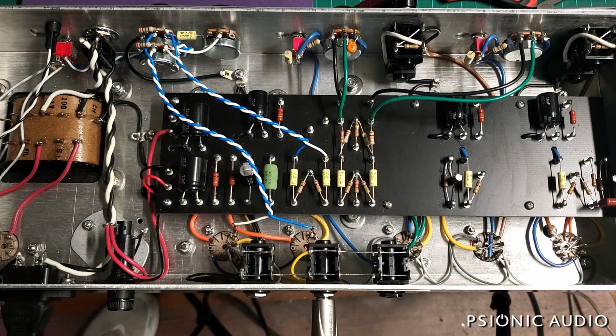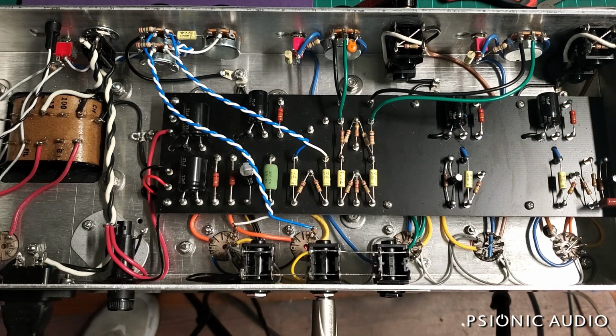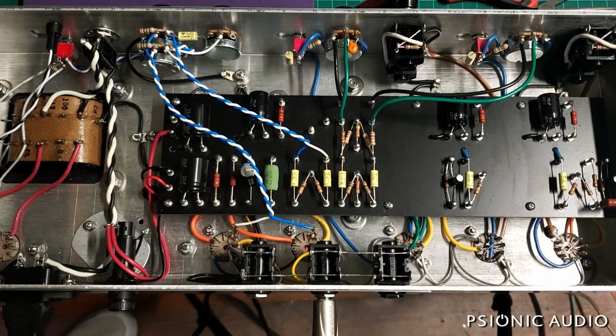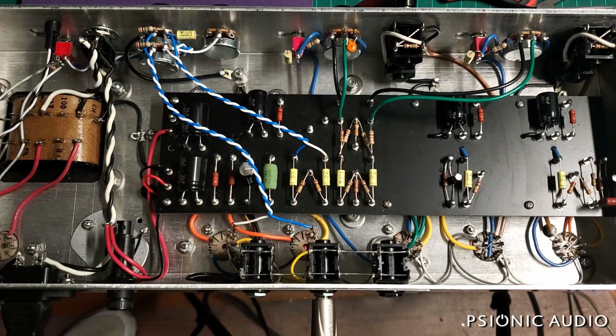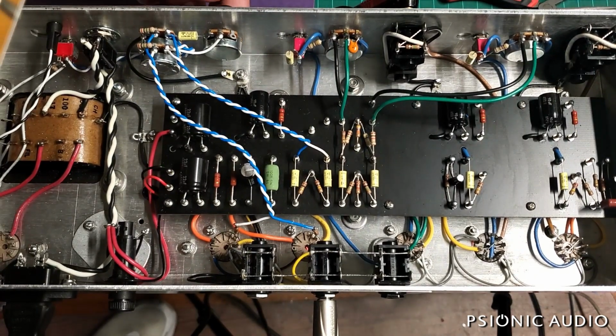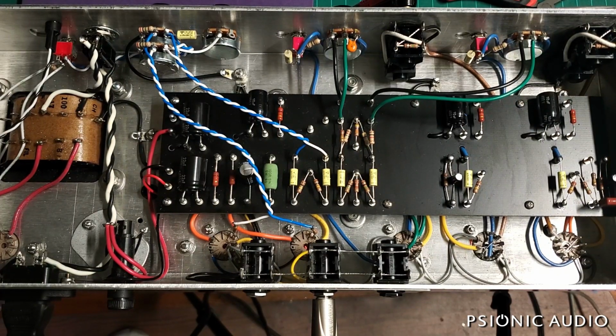I wanted to show one thing in comparison to the AC30, the 65 AC30 restoration part 4, which is right before this on the channel, where I mentioned that the Vox normal channel is darker than my normal channel. Or rather, I intentionally made my normal channel a little bit brighter than the Vox, because I find the Vox too dark until you turn it up to about 2 o'clock, and I wanted this to be more usable for more situations. So here is with the color knob at about 1 o'clock. Very nice balanced sound. This is bridge middle on a Strat.